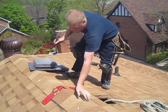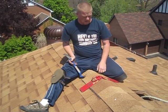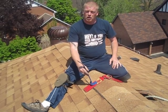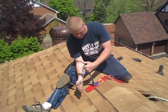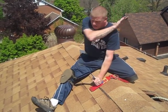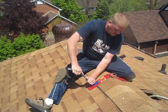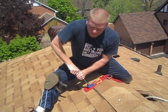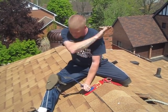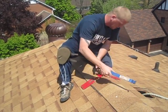So there you guys have it. I'll just go through the uninstall really quickly with you. The crowbar is the key — this is actually a big issue. A lot of guys tend to get up here and really crank on these nails, which could lead to you falling off the roof, and I'm not kidding. If you hit the crowbar in here and hold one end, actually use your arm to get them out, as opposed to just pushing all your weight through the wrong way. Very safely, for you homeowners out there, that's the right way to remove those.